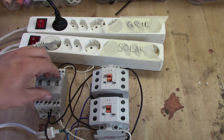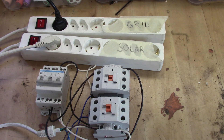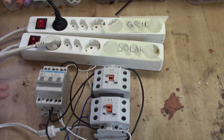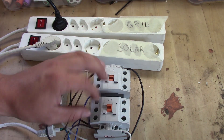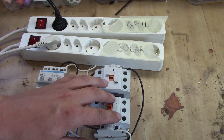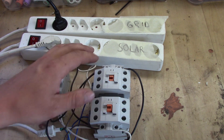And that will be solar priority mode. So guys, I hope you enjoyed this video. What you need to be aware of: these contactors will draw power continuously, so you need a contactor system rated for 24/7 operation. As I said before, you need to have it approved in your area, because in most places you are not allowed to switch neutral, and you're going to use three phases only. But for some inverters you need to switch the neutral as well. And as mentioned before, you need to have a delay between switching.